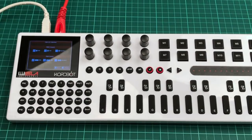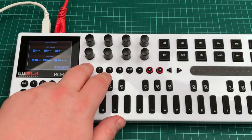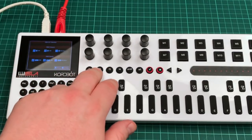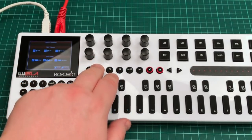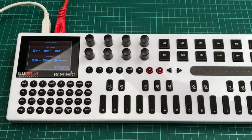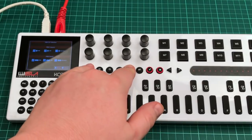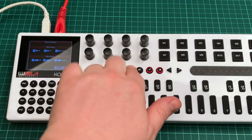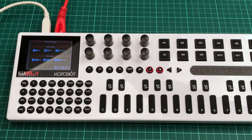To change the setting, you press F1 for DIN, F2 for USB, F3 for wireless. And to set the output ports, you press Shift and F1, F2, and F3. I have my unit set up to use DIN and USB — I don't have any wireless devices I want to use with this unit, so I'm just not going to switch it on. But if you had wireless units, you could switch this on.